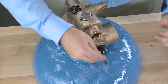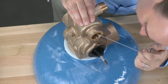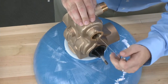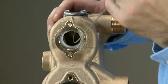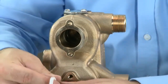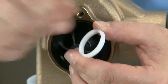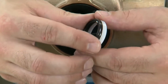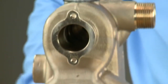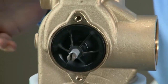As we pull out the 7th seal, we have one more spacer in the back. That is the special spacer that goes all the way to the rear. We need to use the hook tool on this instead of the spacer puller tool. As we pull this out, we can see that one edge has a bevel and the other side has a ridge. The ridge is designed to cut into the seal. With the upper piston now removed and the seals and spacers, we can move to the lower piston.